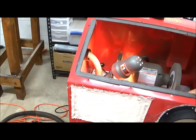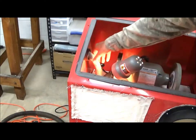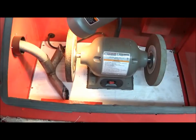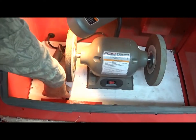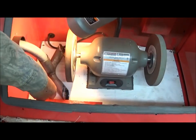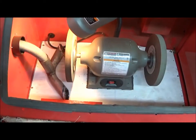We're down in. That's at a position of rest right there — pretty solid, actually. We have our rough fit in our grinding box now. You can see how I have cut these two pieces of pipe at an angle so they'll get the spray from the discharge wheel immediately and catch it on both ends almost as soon as it leaves the wheel. That should be very effective in capturing most of the dust.